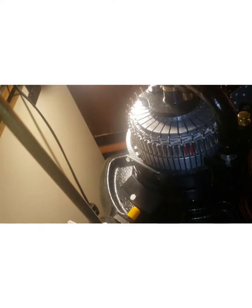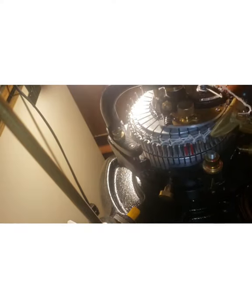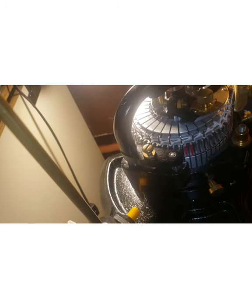Okay, now when I get to 28, I bring this almost to the place where I'm going to put the needles out of work. So let's see, 1, 2, 3 needles out of work. So once I get to this mark, I would put the needles out of work, but I'm going to stop. And then I start replacing all of the cylinder needles.